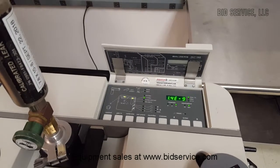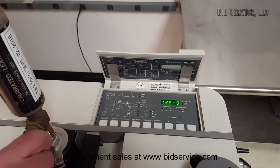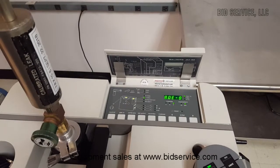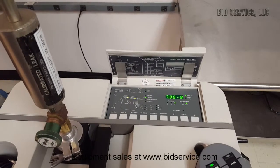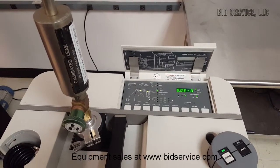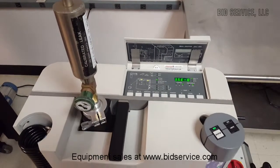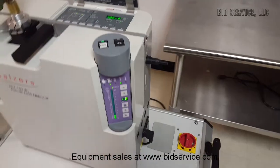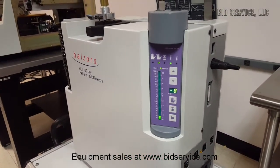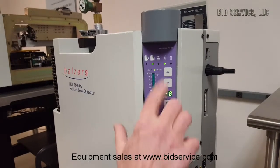It's recovering from the helium leak that was just sensed. We'll go ahead and open it up real quick. Now that we know the helium leak detector is calibrated, we'll go ahead and start leak testing. What I'm going to show you now is how the hand-with-line-through-it icon means it's in hands-free or automatic ranging mode.